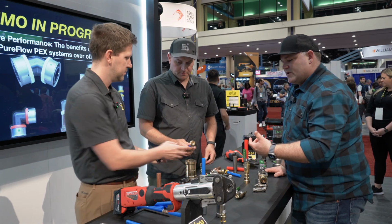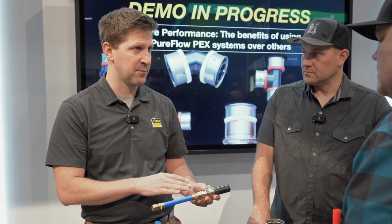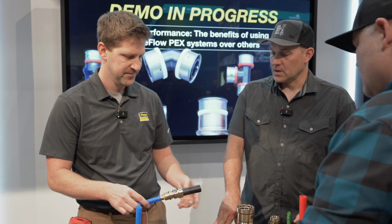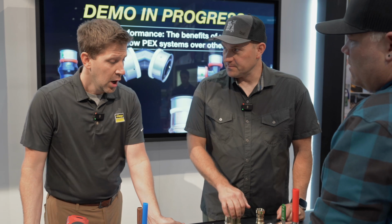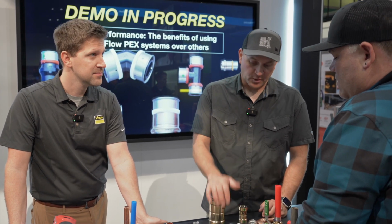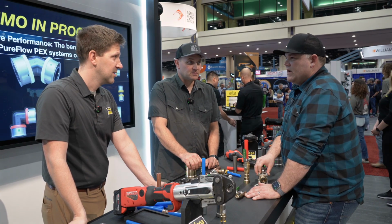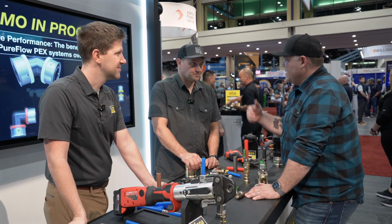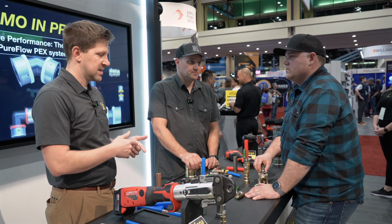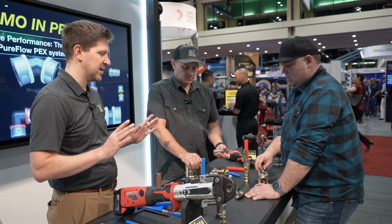And it's NSF, but we can also use it on heating systems, is that right? Of course, yes. So this is NSF approved, NSF 61 for toxicity and health effects, everything you need for your potable water system. What's max temp range? It's going to be the same that we have for all of our systems with the EPDM, so 250 degrees. So we've got lots of flexibility. Yeah, that covers everything basically. Like as far as the transition, I could see it for hydronics, for potable water distribution. Galvanized to PEX, black iron to copper, whatever you need, we're trying to help you get covered on that.